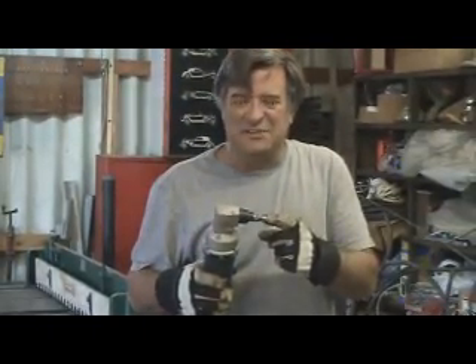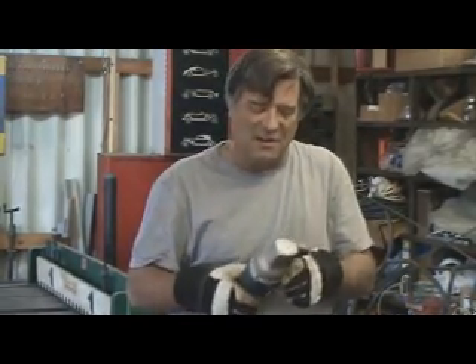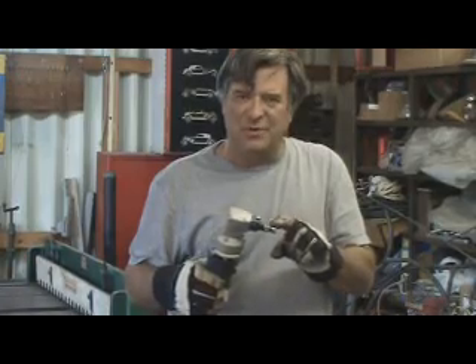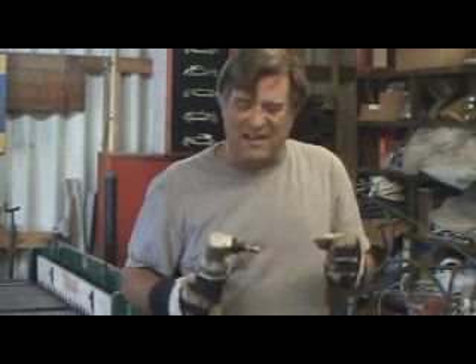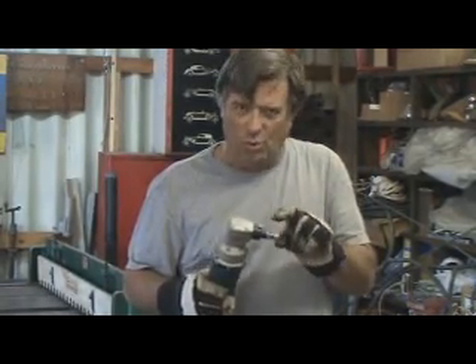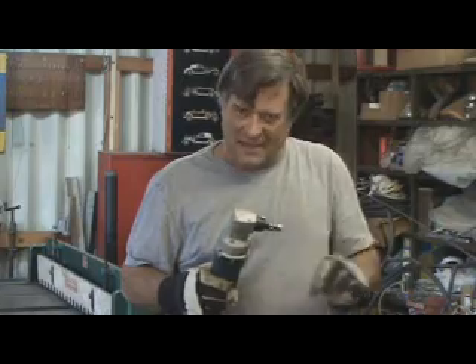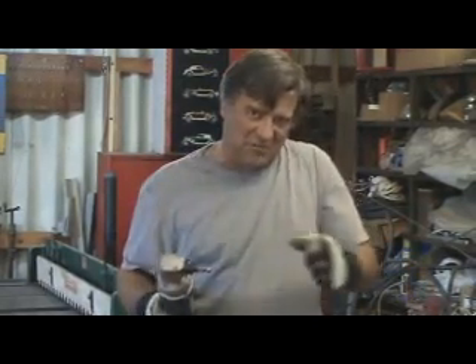Really, really messy — there are a lot of little sharp pieces that fall out of the bottom as you're working along. And you have to keep this lubricated, so like some WD-40 or cutting fluid or something like that, not only to keep the die and the punch cool but to make it cut a little easier. Whereas with the plasma cutter, you just go for it.